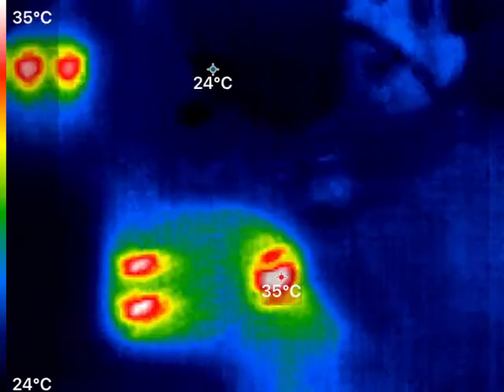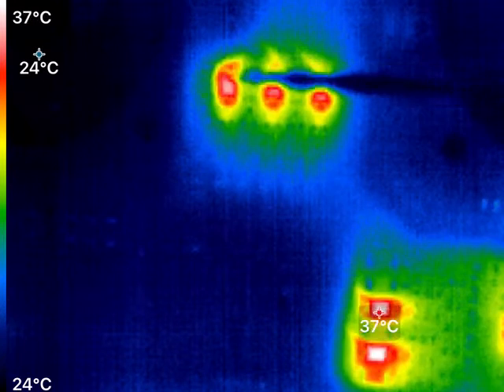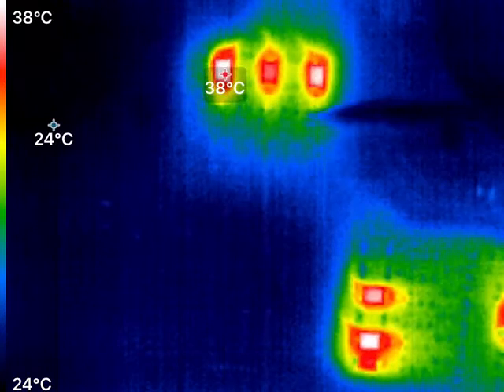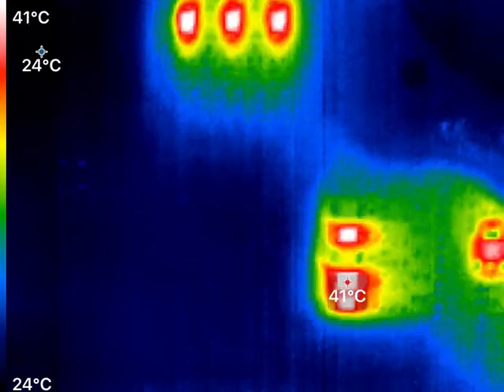Here you can see a different set of cells that have mostly gotten to their final voltage. Every other cell here is slightly higher. This one's off, that one's off, all of these are off, and this one in the middle is off. But we are discharging these two and that one. This right now has about one millivolt of hysteresis, so when the cells are all within one millivolt of each other, the cell balancing process will stop.